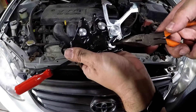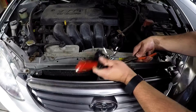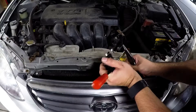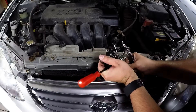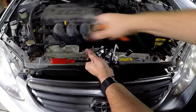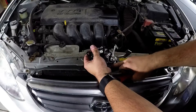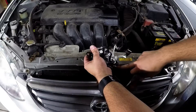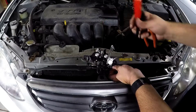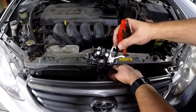So to get the cable in here, I need to push the end of it past the main spring. I know that I'm hooked, and then if I get my pry bar out of here, I know the end of the cable is on the hook. I put this cable slot in this hook so now the cable can pull this.